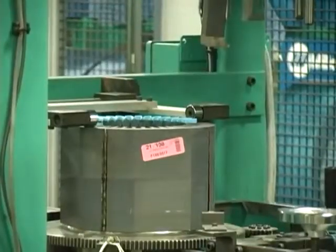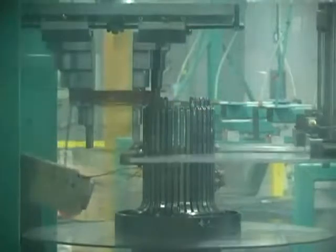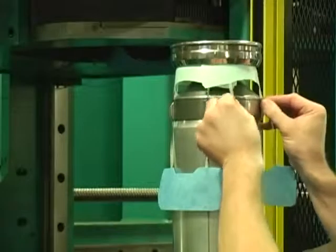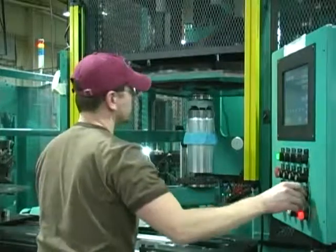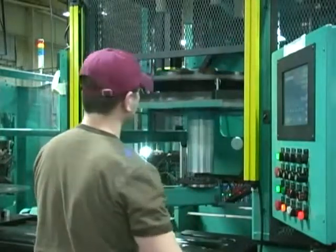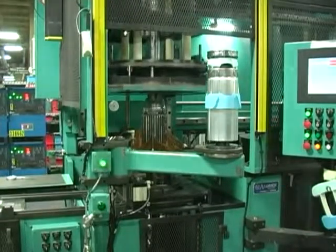Slot liners are inserted, producing high-quality insulation. Winding coils are shed onto forms for insertion into the stator. Phase paper is used on both ends of the winding, which reduces failures. Automated winding movement to a fixture for insertion into the stator.